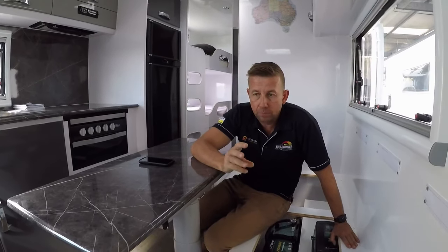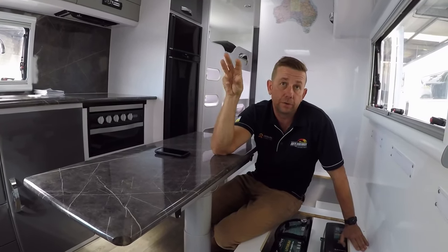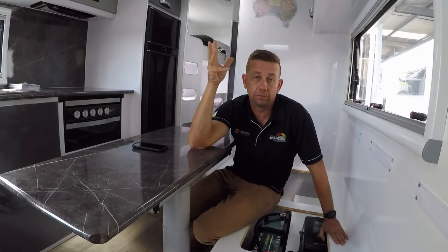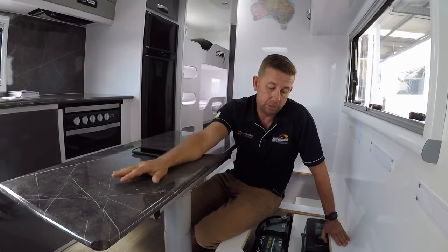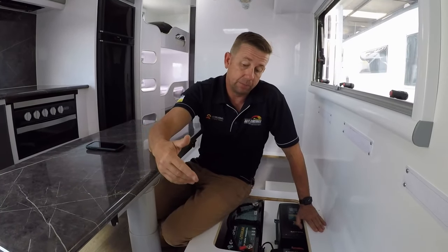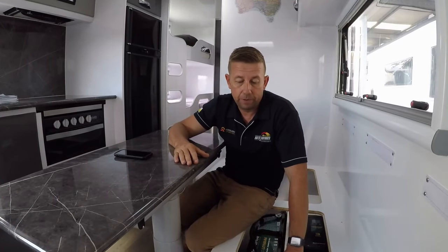That delay also gives the car enough time to get up to speed — your alternator has to recover from the start. Most vehicles we get in here have dual battery systems and other loads on the alternator. The same applies with the external solar panel plug — plug it in and it'll just gradually trickle up depending on whatever your portable panel puts out.